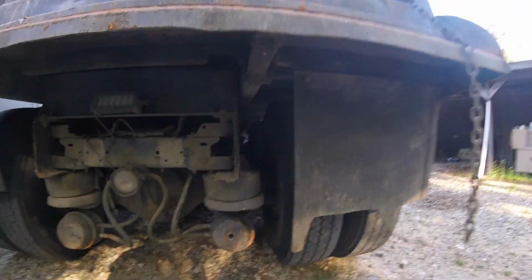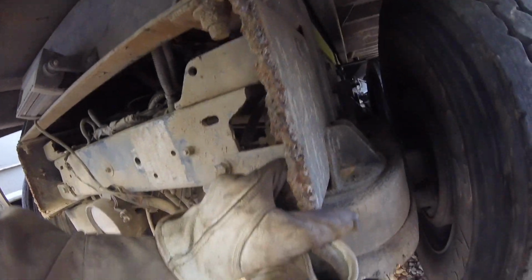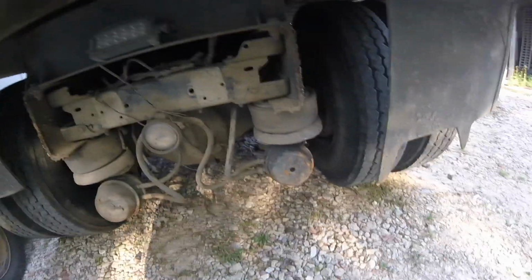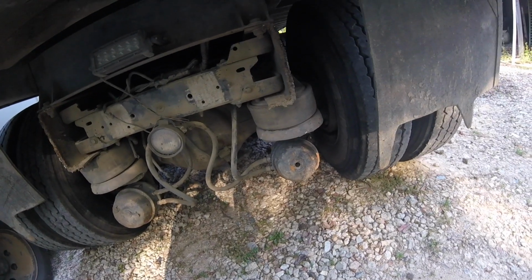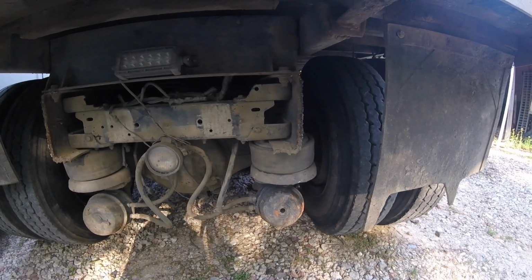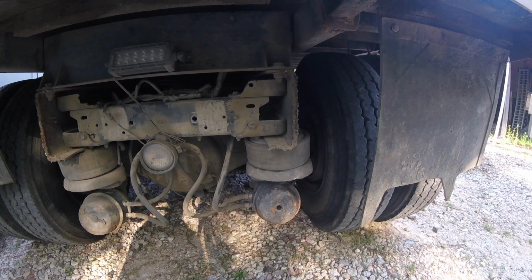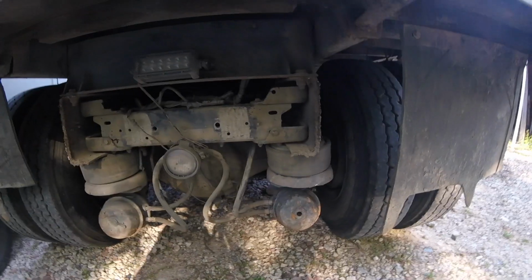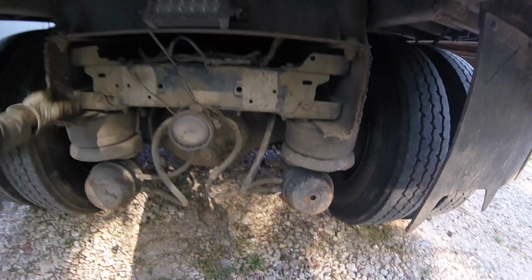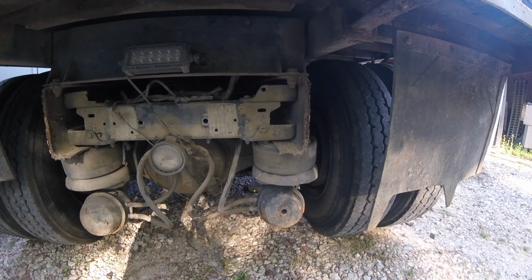So, as you can see, well, I wonder why it came off. It's all freaking porosity in there. Kinda think I know who welded it too. Doesn't surprise me. But that's not here nor there. So I'm just gonna get it cleaned up, get a nice bevel on all this. Get all this old crap off, get a nice bevel on it, and then clean up what's on that one and weld it on. But I'm gonna set y'all up over here.